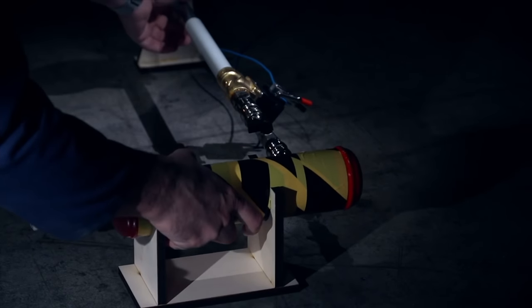I set out to make my own nerf gun even faster, so I needed to upgrade his design. He's using a solenoid valve, which is probably pretty fast, but not as fast as a burst disc. He uses 400 psi air, and I'm going to be using 600 psi helium. I'm also going to be sucking all the air out of the barrel to create a vacuum on the inside of it — otherwise, when the nerf dart goes down the barrel, it encounters a lot of air resistance and steals some energy.